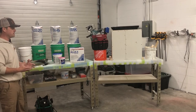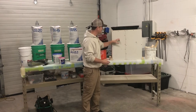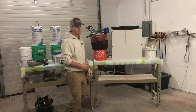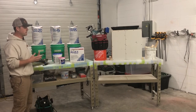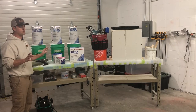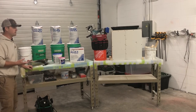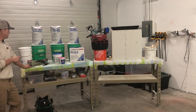Whenever we're doing any kind of big patches or repairs — taping joints, doing repairs, fixing a bunch of nail pops using quick set mud — we always want to sand with the Festool vacuum to make sure we don't spread dust throughout someone's house. It's really easy when sanding a decent amount of mud to instantly spread dust through the customer's heating system, and then the next thing we have to do is pay for a cleaning company to come out and clean someone's entire house.